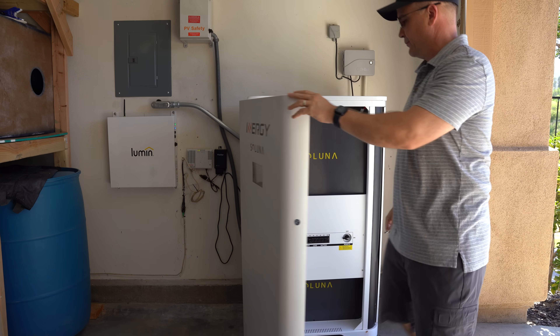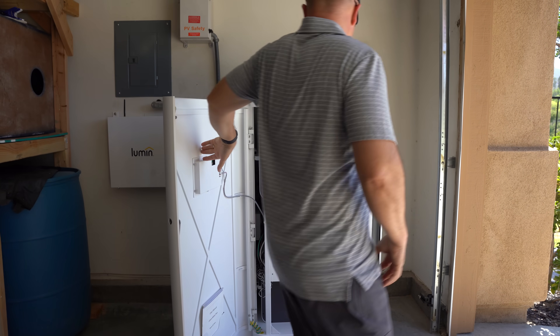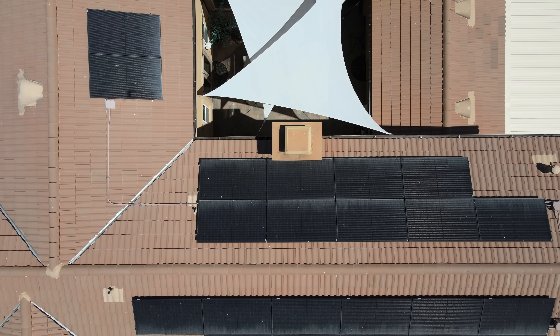EcoFlow is targeting the whole home power backup market with a system that's expandable, modular, and mobile. I did a video a while back detailing my whole home battery backup system, and I think it's worth comparing this system — the EcoFlow — to a fully integrated install. My whole home inverter battery backup system, named the Saluna S12, retails for about $13,000, and I also qualified for a tax rebate to further reduce the cost. With that system, I can actually push power back to the grid during peak hours between 4 and 9 p.m. PST, when the electricity company charges double the rates per kilowatt hour in that five-hour window. With the EcoFlow, you can't push back to the grid, but rather can only power the 10 lines you designated in the app. Second, my whole home battery backup system can accept 8,000 watts from solar panels, whereas two EcoFlow Delta Pros can only accept 3,200 watts of solar combined.